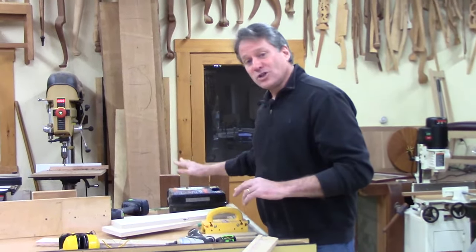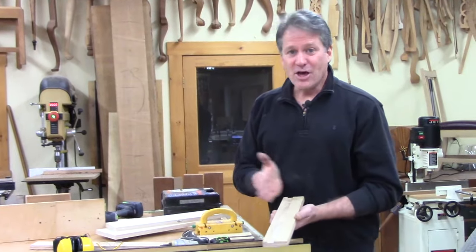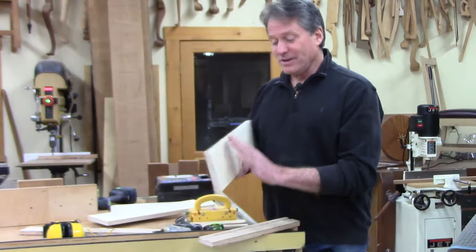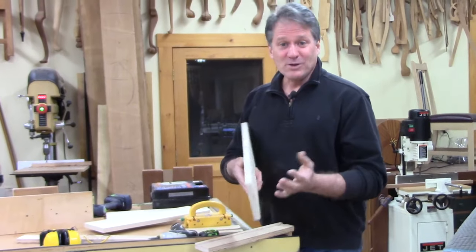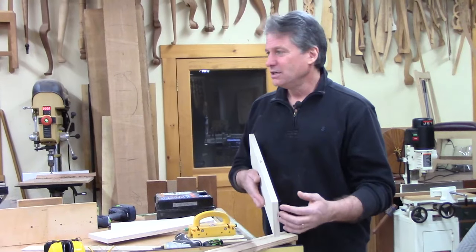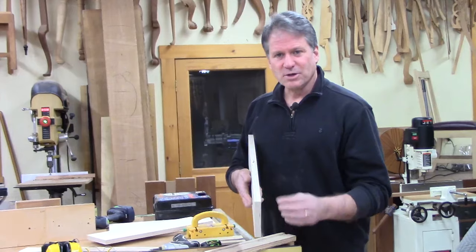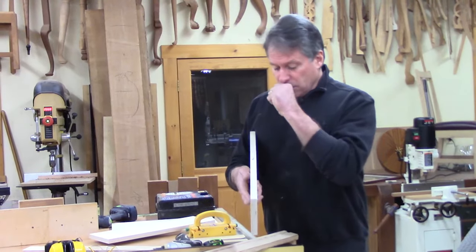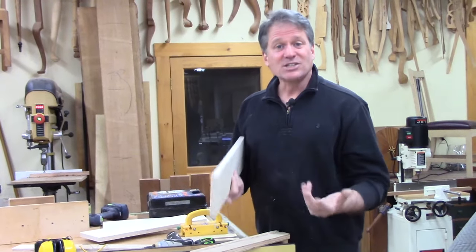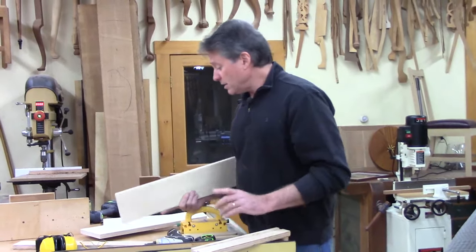And I've used almost all the cutters for this because I built it out to the 3/4 of an inch. Thought I might have to shim a little bit, but with that poplar veneer on there, like most plywood is usually a little under 3/4 of an inch, and Baltic birch is actually in millimeters, so I think it's 15 millimeters. Somebody's going to check me on that, but I think that's true. With the veneer, I didn't need to shim it at all. I'm right at 3/4 of an inch with the dado cutter.